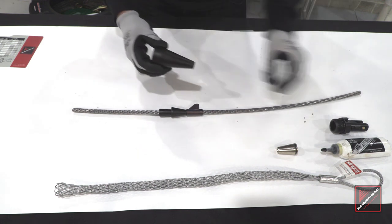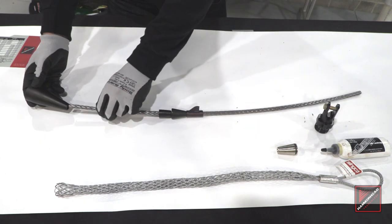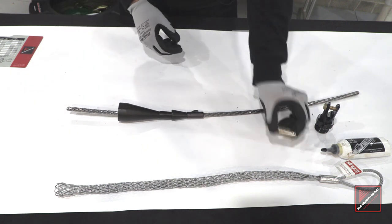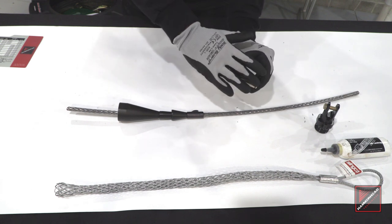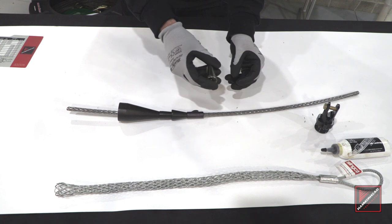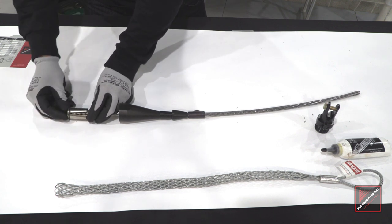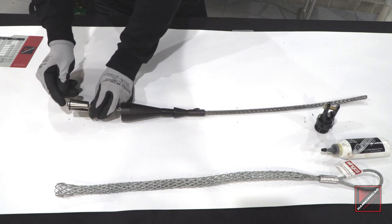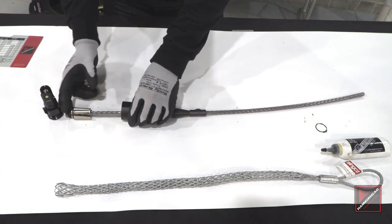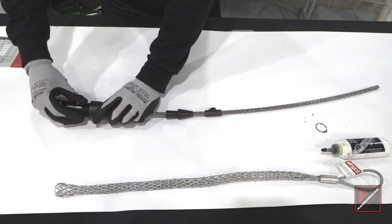Here we have the bigger expander cone. When it comes in the box it will already be assembled. You want to go ahead and twist off the nut, push the body over the cable, and set it in place. The next thing you're going to do is take your jaw set. Make sure you put anti-seize on each face — all it takes is a drop the size of a pea, just wipe it across the whole face. Once you have anti-seize on the jaw set, come back to the cable and slide it right over. When you put the jaw set over the cable, you only want a quarter inch of cable hanging out behind it. Now to assemble the retention nut, slide your expander body back over the collets — being careful not to move them — and twist on the nut itself.